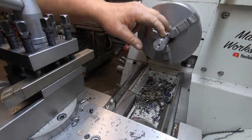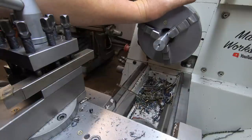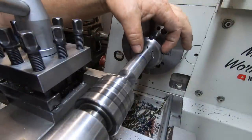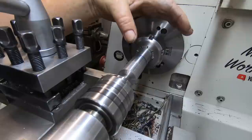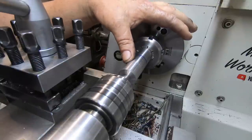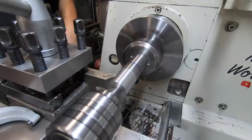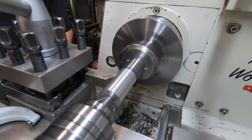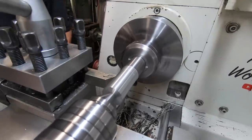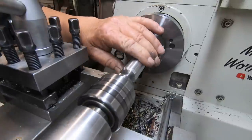I'll shift that out now - I might even hold it in a collet so I know it's all concentric as best as possible, because this three-jaw is not real good at being concentric once you move it. Set up in a collet now - I'm 50 mil from this end, that'll be the short end, short thread. This has to be turned down to 24 mil - I'll go a fraction under for the thread. Okay, we're right to start threading.